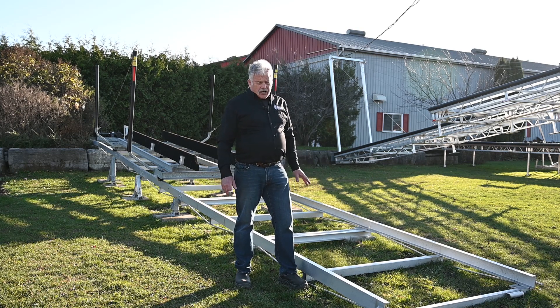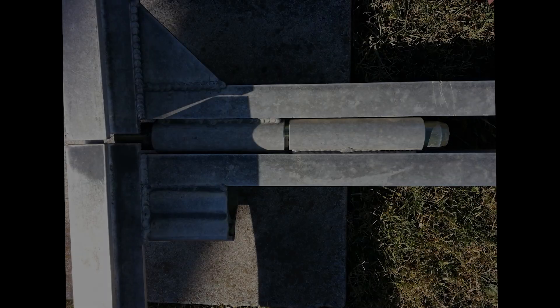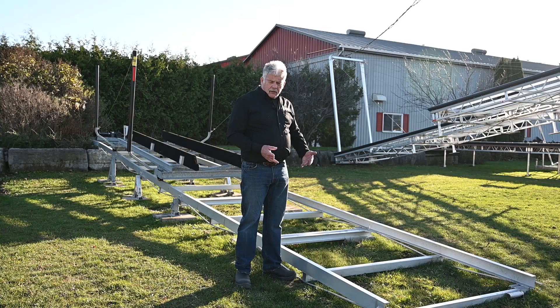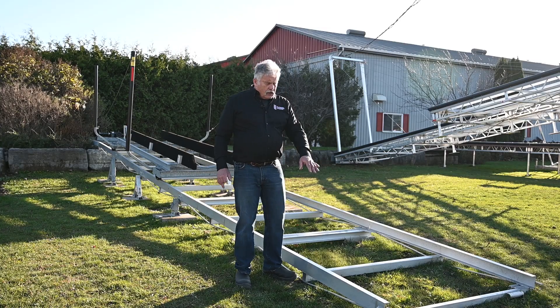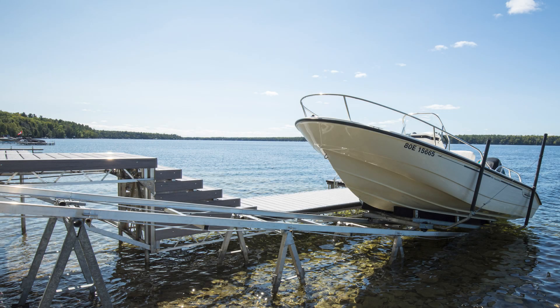This particular one is a 6,000 pound model. All of them feature quick-detach hinges so there's no nuts or bolts to do up to attach your tracks — you just put two pins in per 10 foot length. They all come with levelers, and as you come down over the rock you put a set of levelers in, then go down to the next set where you put another set of levelers in. The holders for that are all built in, and all our levelers are totally adjustable.